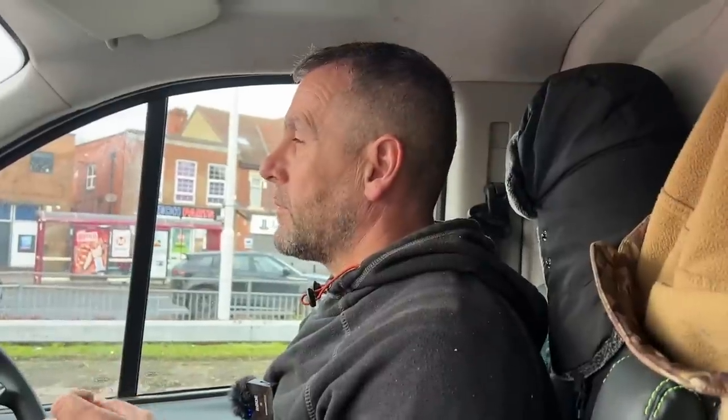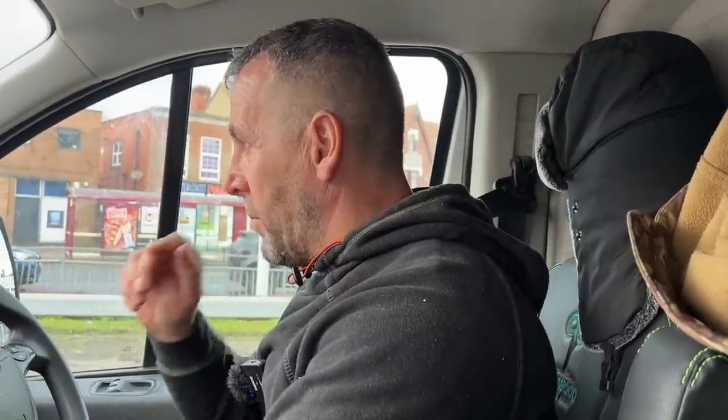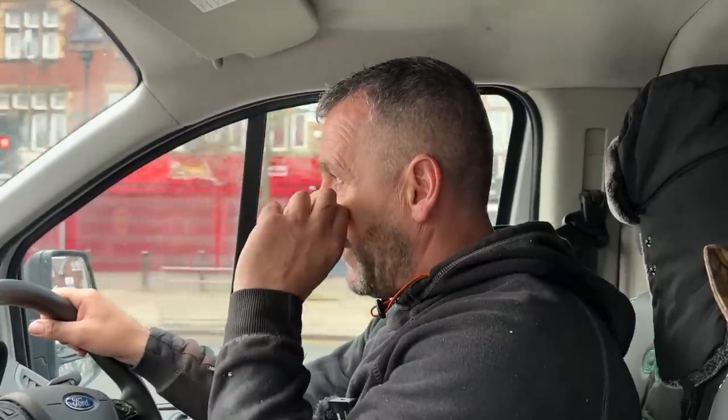Will Ellis asks: you put some sort of sheeting up before plasterboarding - can you give insight as to why, and could you replace it with moisture-resistant plasterboard? The vapour barrier - the whole issue is you put it up but then put holes in it, so a report said it was pretty redundant apart from helping with airtightness. You could use foil-backed boards as that is a vapour barrier in itself, but they're quite a bit more expensive. A roll of polythene is about £40 and will do a room.